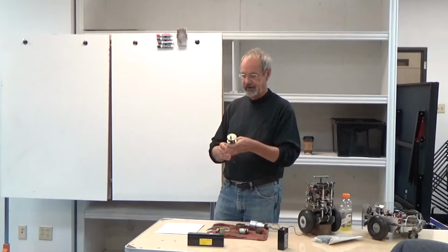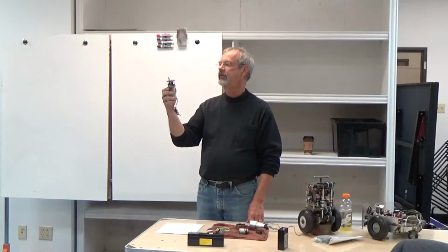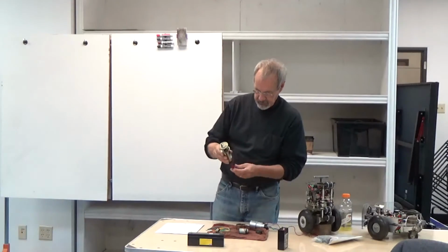And then 80 teeth on the spur gear, which is pretty good. That'd give you a 10-to-1. You need 800 teeth to get 100-to-1. Well, that's a huge gear. So typically the way that's done is in multiple gear stages. This one says it's about 20-to-1 and it does it with 2 gear, I guess that's 3 gear stages. And essentially what that is, small gear driving a large gear, driving a small gear, driving a large gear.